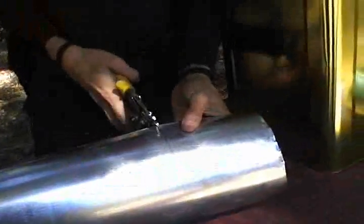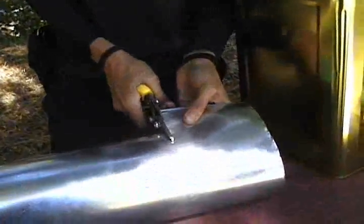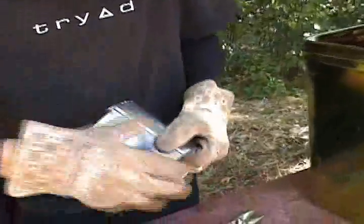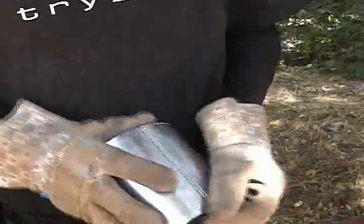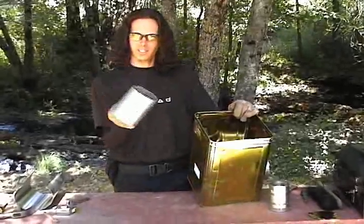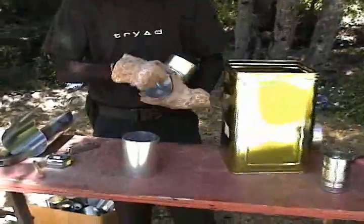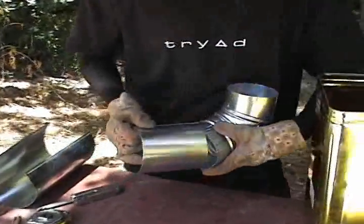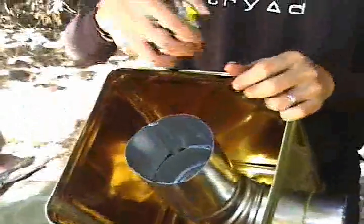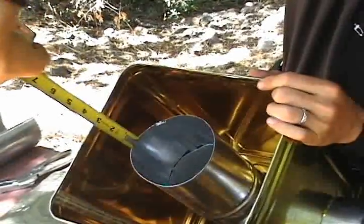Just like before, mark and go around the whole length of stove pipe with your tin snips and cut. Once again, wear your gloves. Once the piece is cut, snap it together. Take your file and file the edge. Once this piece is finished, take out your elbow and fit it over top of the crimped edge. With the full stove pipe in place, you can see that it rests about an inch below the top of the can.